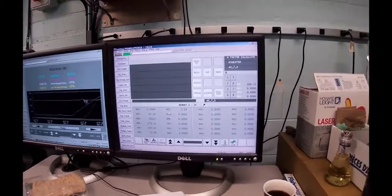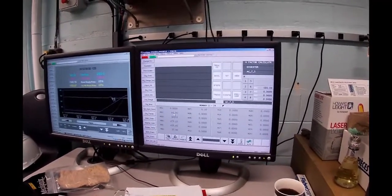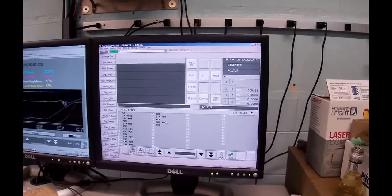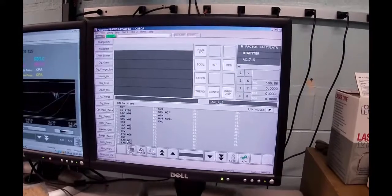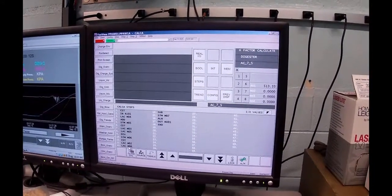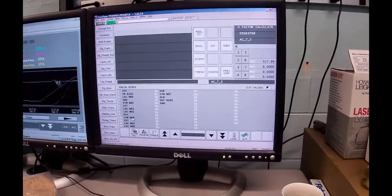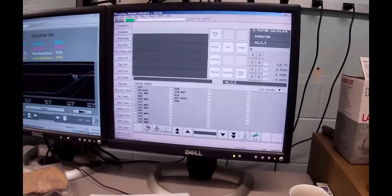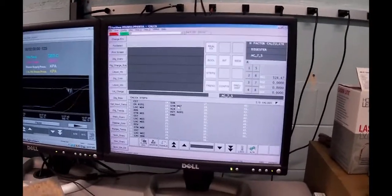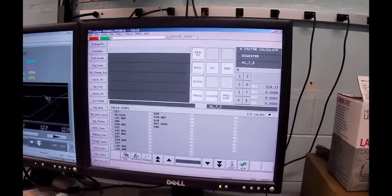Then the next thing is, and I might as well point it out, memory 2 has got the 43.2 part of the formula in it. So if I go back to steps, I cleared the stack off, load in memory 2, which was the 43.2, load in memory 6, which was this part over here, the 16,113 divided by the temperature in Kelvin, and subtract them. That's what we're supposed to do, and store that in memory 7. So that's all this stuff.